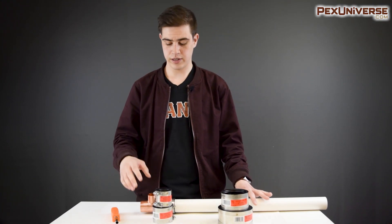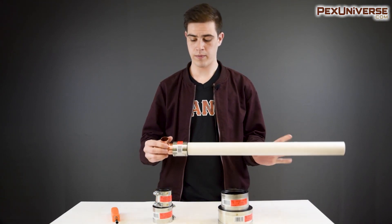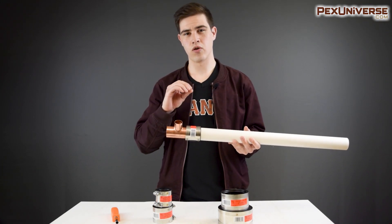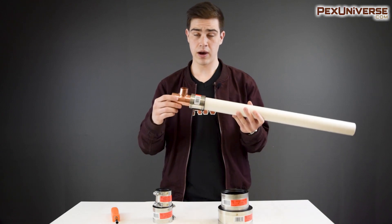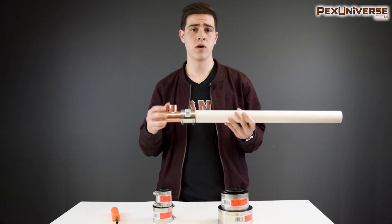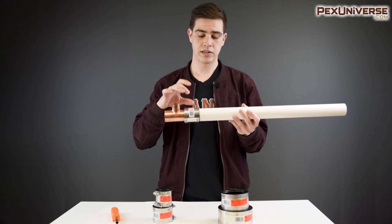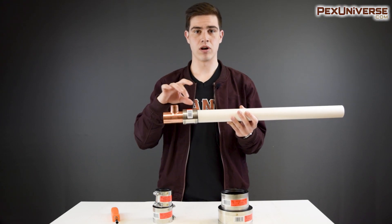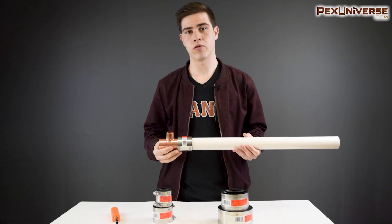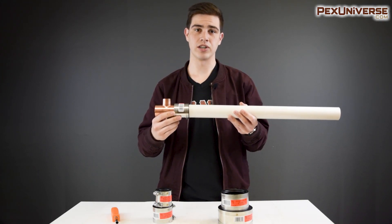The biggest difference is the problem that you run into. Normally if you have an older house or a setup where you have two different types of pipes that you need to connect, you can't just use a normal coupling to do so. Say you have copper to PVC, or maybe even cast iron to PVC or cast iron to copper. If you put a normal coupling on there and tighten it down, since the coupling is made for the same diameter on both sides, it'll start to warp. Once it starts warping, you can't create a watertight seal or an airtight seal. So you want to make sure that you're getting the right coupling for the right job.